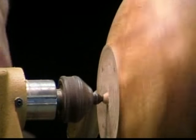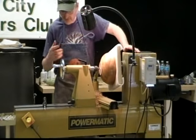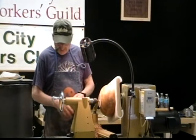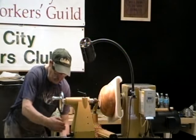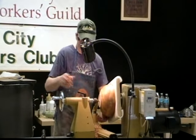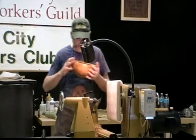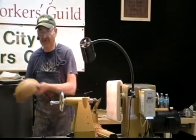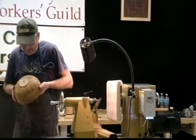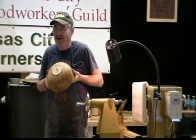Now, what I would do at home is I would have a little bowl of dust. When I'm sanding with the disc sanding, I'd be doing maybe 50 or 60 bowls at a time. The dust would collect on the ways, and I'd just get a bowl and tip it in, so I'd have a bowl of really, really fine dust. Then take off the bowl and pour in some of the dust and put thin CA in beside it. Fill it all up, leave it to dry, and then put it back and finish it. So that's what I do. And there's this lovely pattern of little dots all around the bottom. And people say, how did you manage to get all the knots in such a nice, neat pattern?